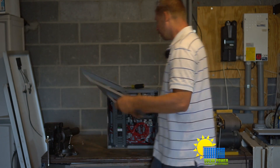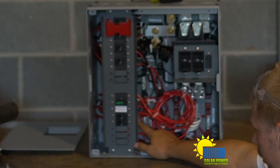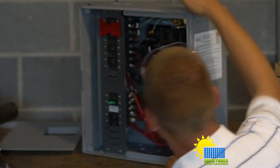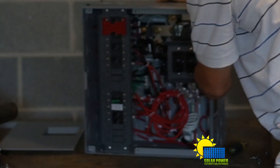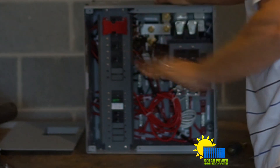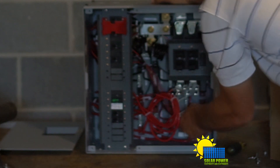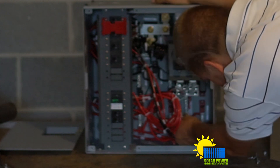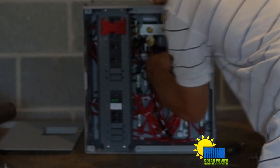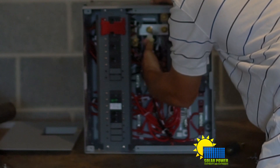Now, this thing is already pre-wired. We've got some number six gauge wire with some real nice crimped connectors inside of here. I'm really happy with the way this looks already because it just looks solid. I will have to go over the electrical wiring diagram before I decide to do anything. It looks like a white wire - I'm assuming that is for our neutral leg. AC neutral, that's right, and everything's labeled inside, real nice and organized.